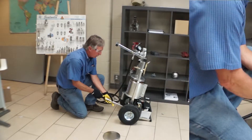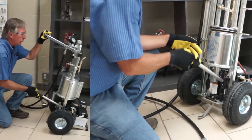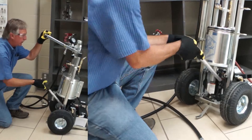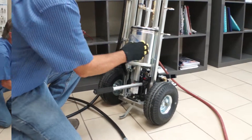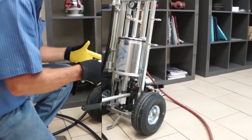Use the handle to pump the jack up, which lifts the elevator plate and pail onto the loading plate. Once loading begins, there will be a large pocket of air trapped at the top of the pail. It is essential to purge this air for proper loading.